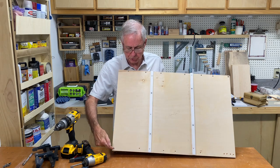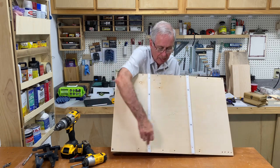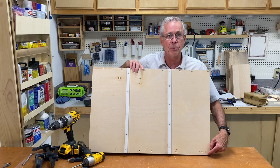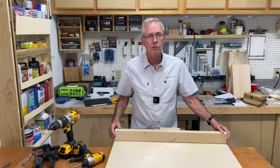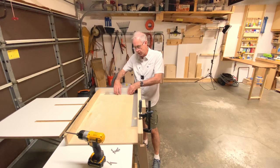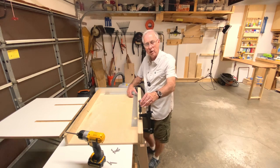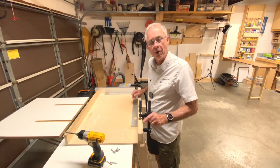This is the swing edge — there's one screw holding that block on. These will be my other mounting screws. On this side I've put four holes really close together on this edge, because this is where I'll make my micro-adjustments to make sure the sled is true. I can swing the fence to make sure it's square. I'm using the table saw fence to line up at 90 degrees with my sled fence, then clamping it down. I'll put a screw in the first hole of my adjustment area, then make some cuts and check for squareness.